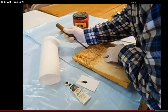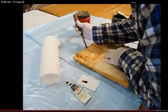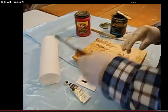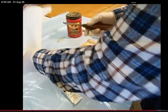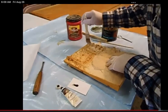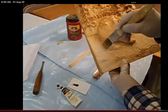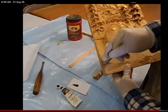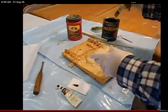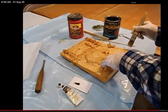Right through the wet varnish — it doesn't hurt the chisels, it doesn't hurt the carving — just right down through the bottom of that imperfection. Then I just take the paper towel, wipe it off; a little varnish on the chisel is not going to hurt at all. Then I just go back and re-varnish that area. You can see where the reflection of the tree is from those cuts — the capillary action sucks that varnish in and it makes the reflection.